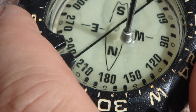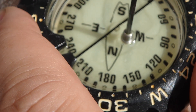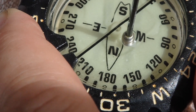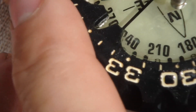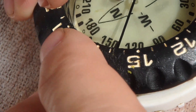The final step, with all the gas evacuated, is to replace the grub screw. Ensure that when you install the grub screw, at its greatest depth, it won't come in contact with the rotating portion of the compass on the inside. You can determine that it won't come in contact by taking a peek through the side port of the compass.